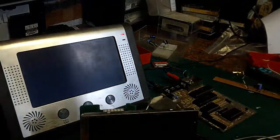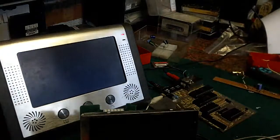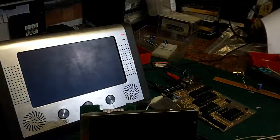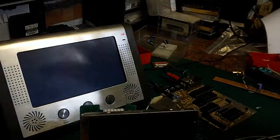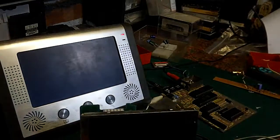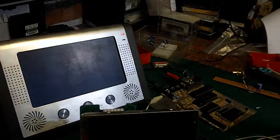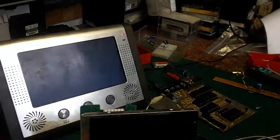I think it's something that Jules Pacoulon came up with, if you have a look for his YouTube channel, if you're into Spectrums and things like that, it's fantastic. Basically, it reintroduces a bit of back porch into ZX80s that don't produce a really good back porch.